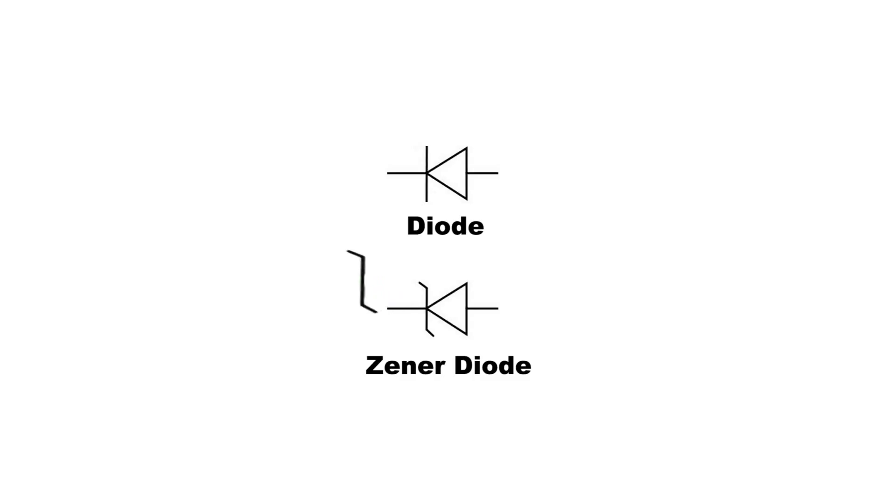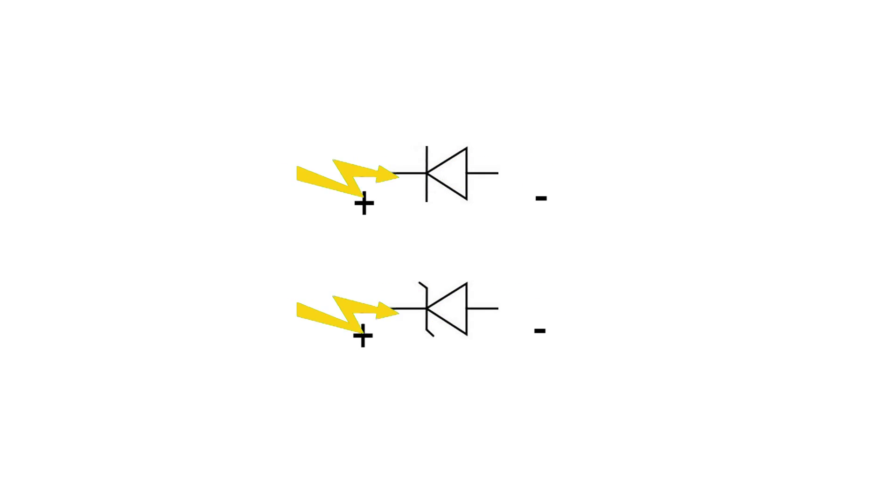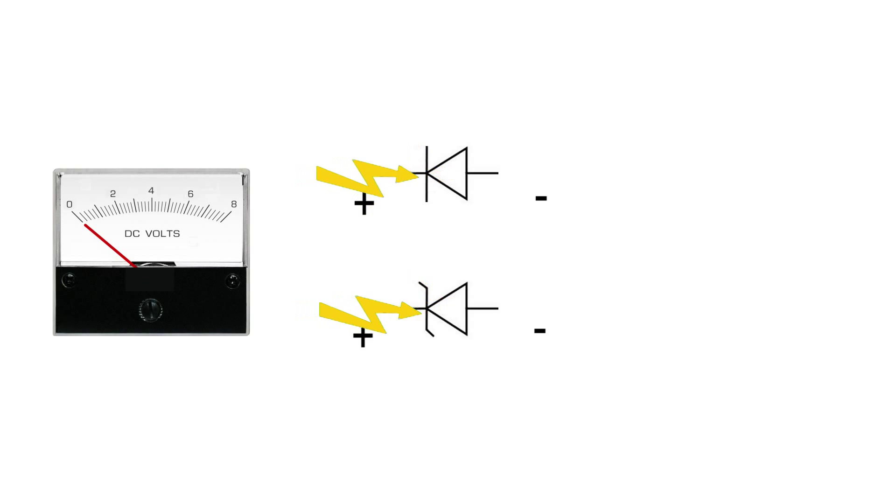If you recall, this is what a regular diode looks like. A Zener diode looks almost the same, except that the little bar across the top has two bends on the ends — it kind of looks like a misshapen Z, so it's easy to remember the difference. Like a regular diode, a Zener diode will conduct electricity in one direction. But if we reverse it, it blocks it. However, if we increase the voltage, we'll reach a point where the Zener diode finally gives up and lets the current through — whereas a regular diode will continue to block the voltage. That's the big difference.